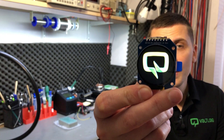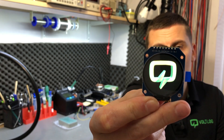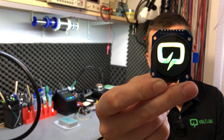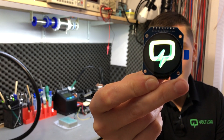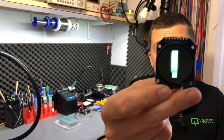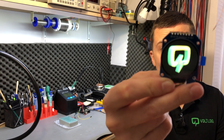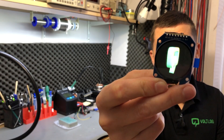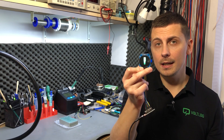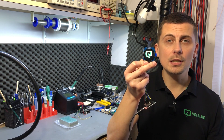Here is one example: this is a 1.3 inch 240 by 240 pixel round display, and it even comes installed on its own little breakout board which features a 0.1 inch header for easy connection with Dupont wires. You can get such a module for cheap on AliExpress — I'll place a link in the description below. Note the interface is not some complex LVDS or HDMI interface; it's just a simple SPI interface that you are probably already familiar with. Join me in this video to learn how to control this type of display module, connect it to your favorite development board, and what libraries you can use to show pictures and animations on it.